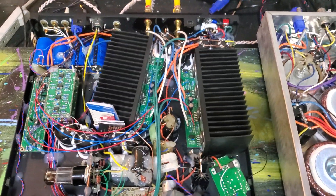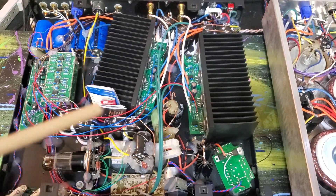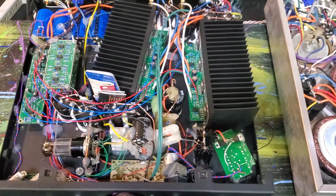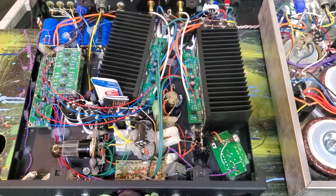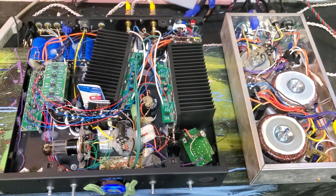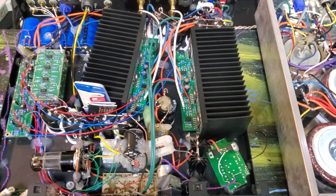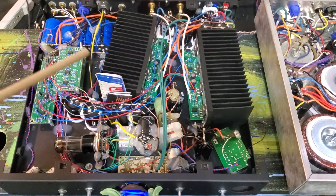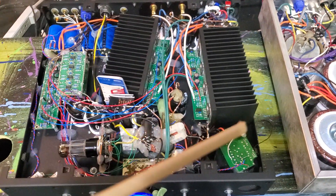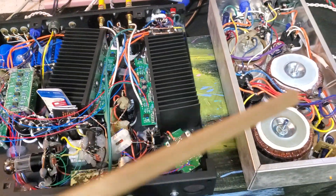When you build an amp like this you have to pick the right ground. The way I build amps with all this wiring it looks a little messy — I haven't tidied it up yet, and I even have paper to insulate the heat sink from some wires. But finding the right ground spot is very important; otherwise you're going to have a battle of grounds when you start testing, and those battles are not easy to fight — grounds are stubborn. If you have a PCB and don't lay it out right to begin with, good luck fixing the ground. The way I do it with all hardwired wiring, I can do true star ground — even three-dimensional star ground — which is not possible with a PCB that has a ground plane.